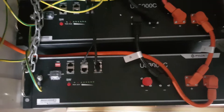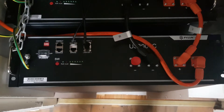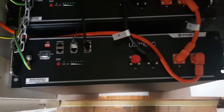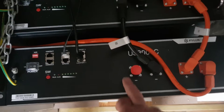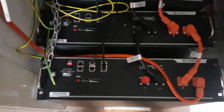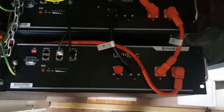A lot of people measure the voltage of these batteries just to make sure they're okay, but you don't need to because you've got a BMS system within the batteries themselves. This master battery — our new one — will control all the others and control the charging and the balancing. So there's no need to measure voltages here.